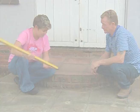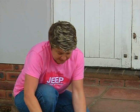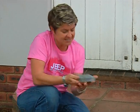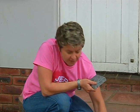Either always work with a spirit level or a straight edge, just to make sure that you are going in the right direction. Now, the tile that Garth and I have chosen, it's a smart tile from Smart Stone. Take a look at it. Most important thing is that it's nice and thin, so it's not an ordinary paver. Now, if you were working on a surface that did not have a concrete base, then you would use the thicker pavers, which is just your ordinary standard pavers. However, because we've already got this concrete base, we don't need to really worry about the groundwork.